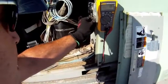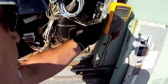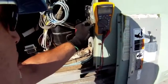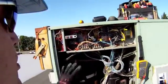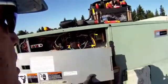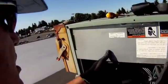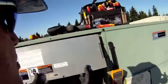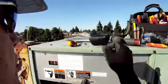I can replace the electrical connections on the capacitor, replace the boot connector, make sure that's on there nice and securely, then close up the unit and the electrical panel and turn this unit back on. We'll be ready to cool that conference room and keep all those people in the meeting downstairs nice and cool on this warm summer day.